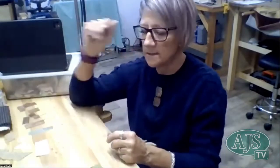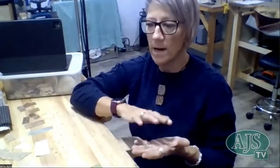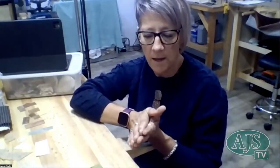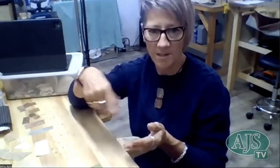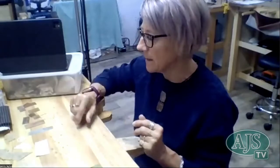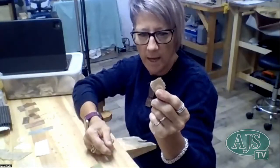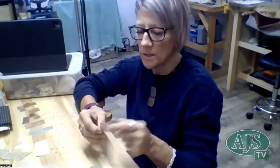You can also use things like sandpaper, but you must make sure that your sandpaper or anything like the fly screen that I mentioned is sandwiched between two pieces of metal, so that that doesn't imprint onto the rollers of the rolling mill. That would be disastrous. Someone would do anything like that. Materials as well, I've got some burlap or hessian that works really good, and you can distort that a bit as well.